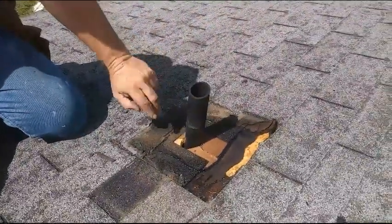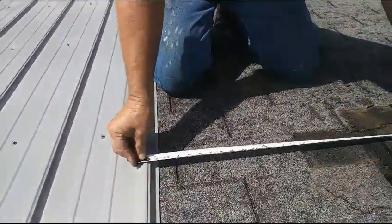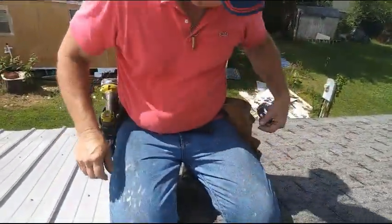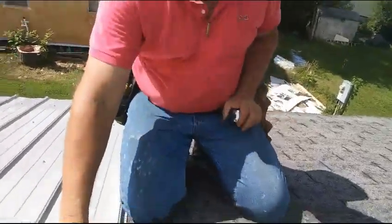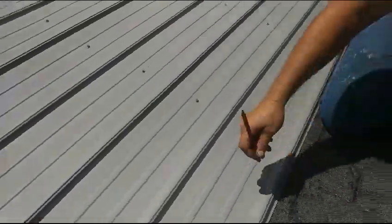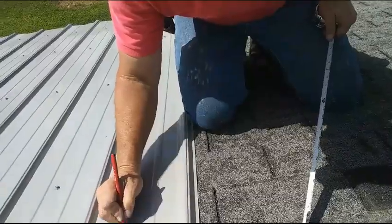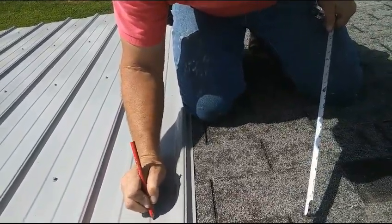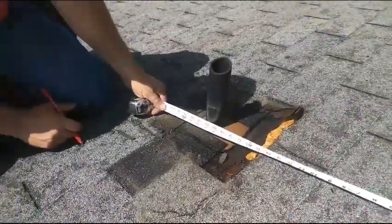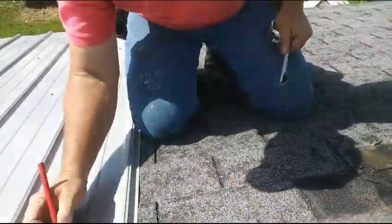Taking off the roof jack that goes around this plumbing vent, what we're going to do is measure 25 1/4, 25 1/2, 27 1/2, and write down that measurement right here. And then transfer that to the sheet that we're going to fix and put up here, but we need to have a top, which will be 20 to 22 3/4. Give myself room.